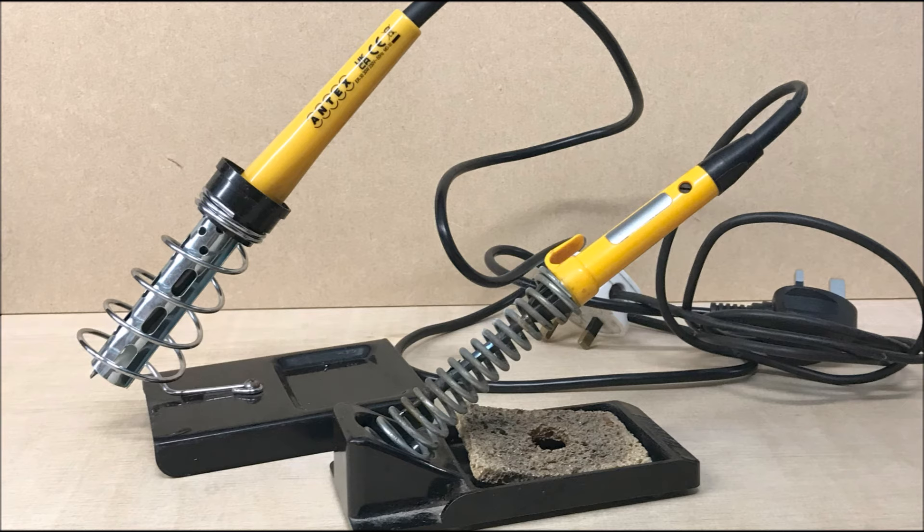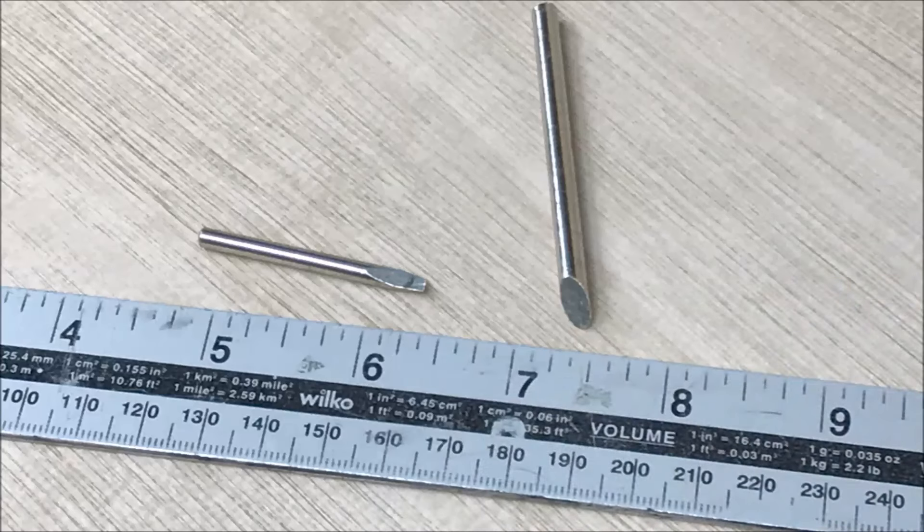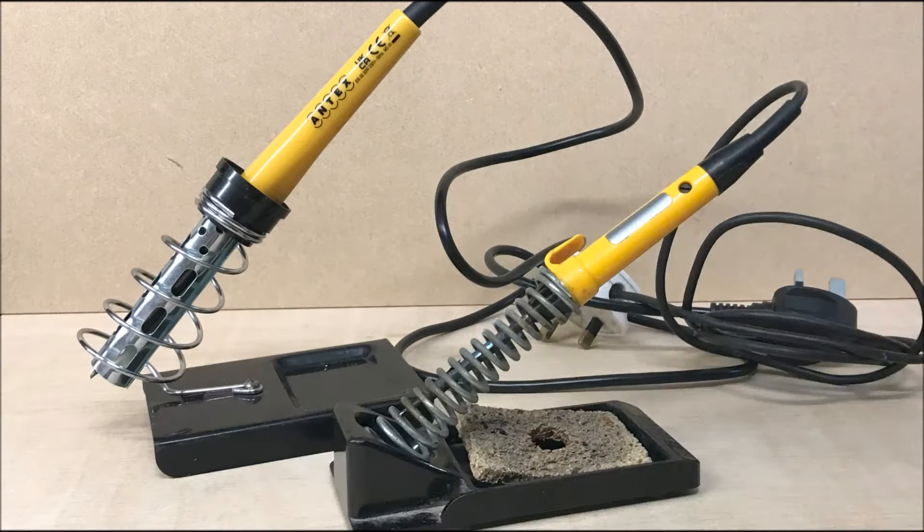Don't buy something that's £3.99 because you'll get what you pay for. The value of buying a decent iron is in both the tip you get with the iron and the fact that you can buy replacement tips for it. Most irons are electric — they plug into the mains. You can buy gas ones with a gas canister, but for now stick to a mains one. They're all rated by watt, which basically gives you how much heat is at the tip and how quickly they replace that heat when you use it up. The rear of these two irons is 30 watts, which is absolutely fine for everything we're going to do on this video.